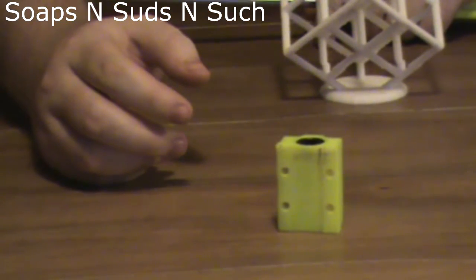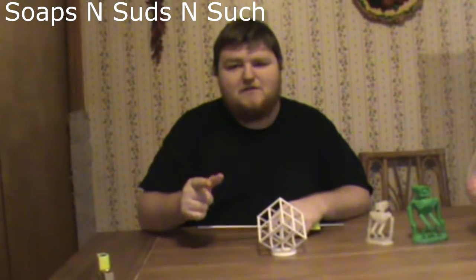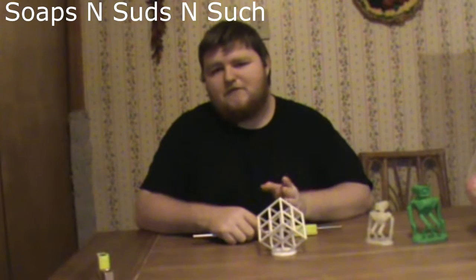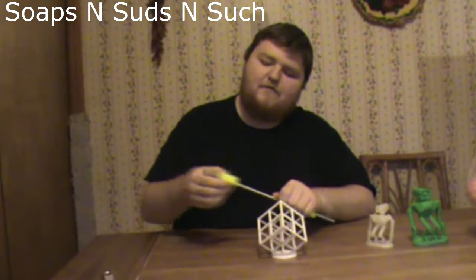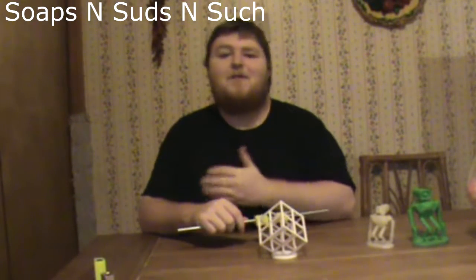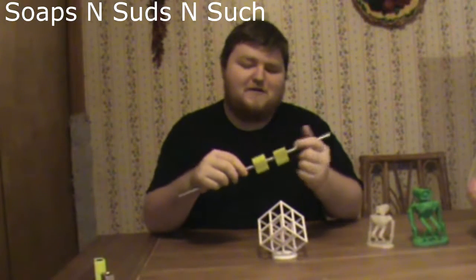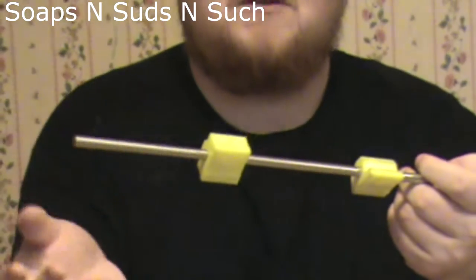The version 2.1 comes with the longer bearings already, so you'd have those instead. But let's say you want to go quiet — you want to go iGus. I have iGus on my printer and they're not hard to install, but they're hard to get to the same level of smooth movement as the standard bearings, at least in my experience. I can move the standard ones back and forth relatively easily, and it's the same with the iGus individually.